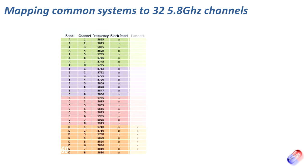We've got our 32 channels that a diversity 32-channel receiver will hear, and there's the Black Pearl hearing them all. The next one we'll look at is Fatshark. Fatshark and ImmersionRC predominantly use the same channels and they map onto the main ones in Band D. So I now know that I need to put the Black Pearl into the D band and select one of those channels — it's probably going to be channel one.